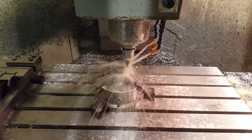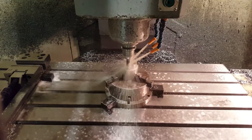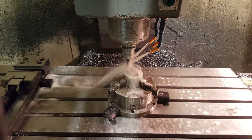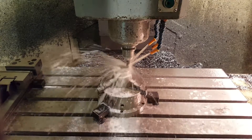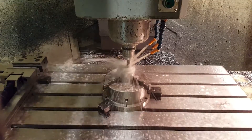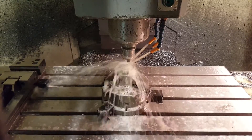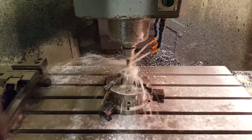So, how about material? There are many videos on YouTube showing how to mill gears in wood or plastic. This is probably because for a standard gear profile you need to use a very thin mill, making it almost impossible to mill thicker gears in tougher materials. However, with this modified profile you can mill with the same diameter on the mill as the module you want to make.